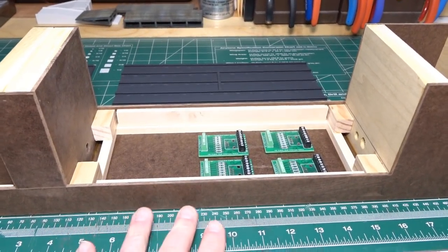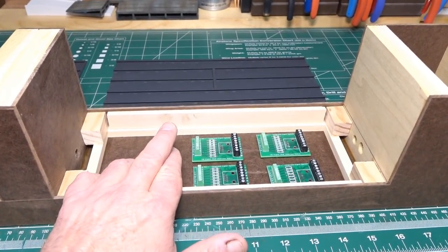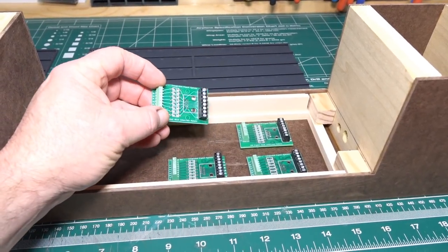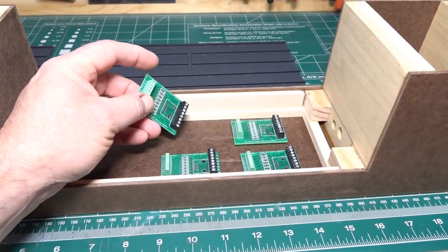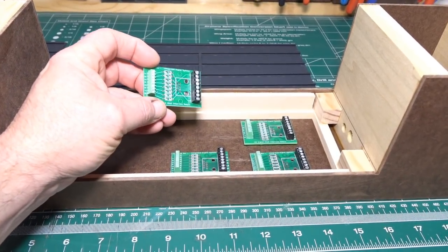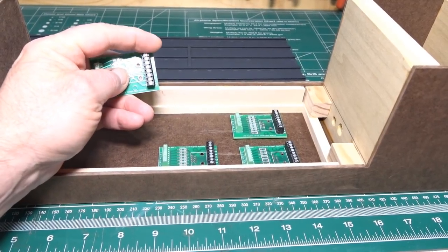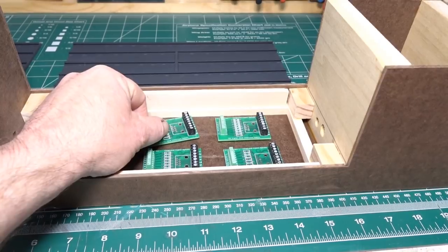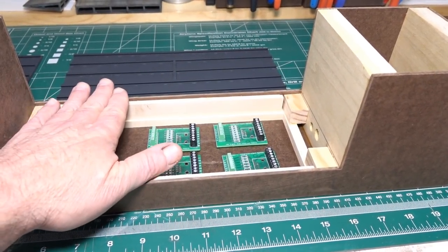My thought is, alright, so I'm going to bring the wires in, all those tiny darn little 30 gauge wires from Integrated Signal Systems. I like to use these shim cards. They're nice. They have a little terminal block for the tiny wires to come in. I can add resistors right to the board, and then you connect to the cables going back to the CMRI boards. I was going to put them all in here, and then have a piece here.